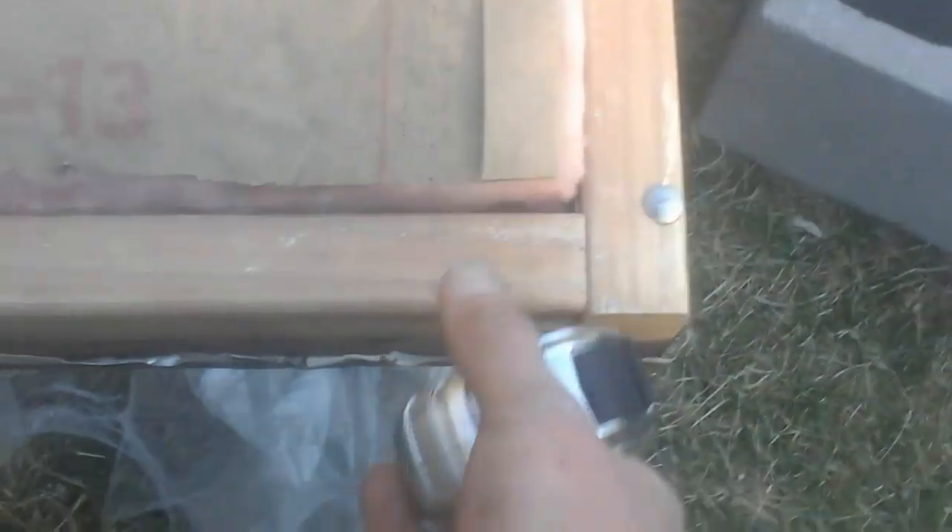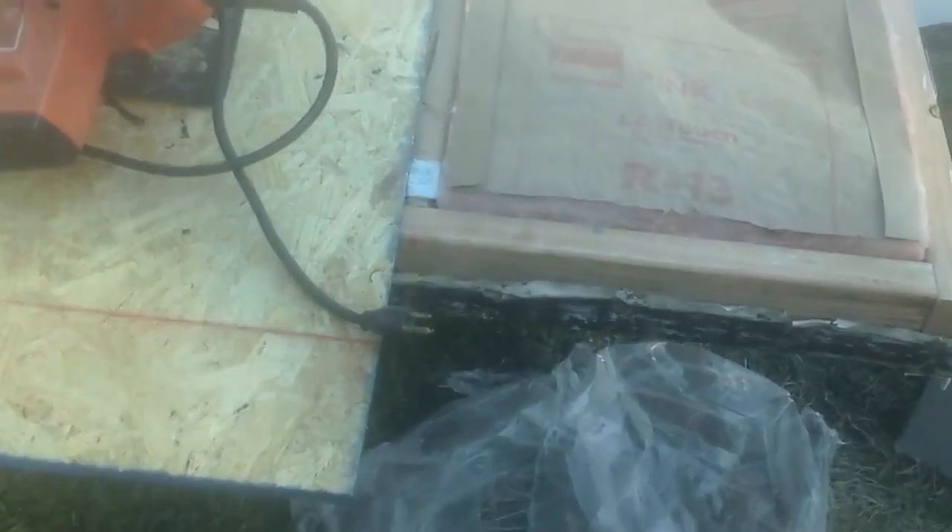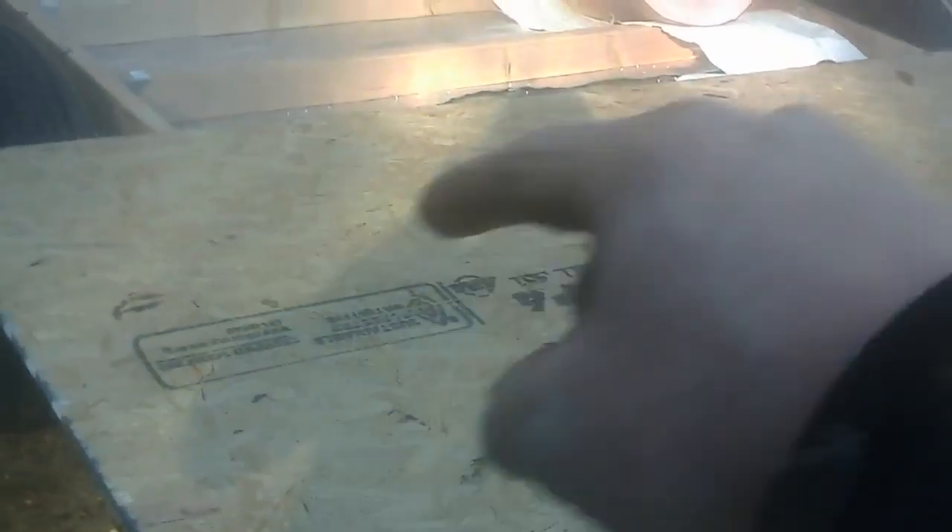Hello YouTube, I'm back for day 12. As you can see we're laying the insulation in. I found out I messed up a little bit. To measure the 16 on center, you're supposed to do it from here and then go down — it's like 17 and a half inches, which is definitely not 16. So I've got to go from this 2x4 over to the one here and then take one of my plywood sheets and rip it.